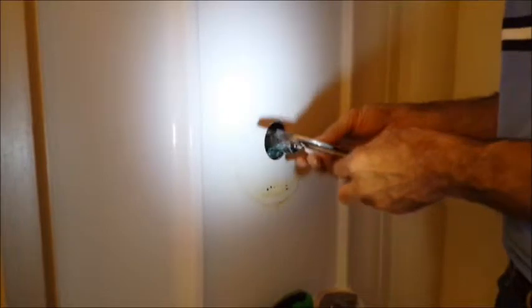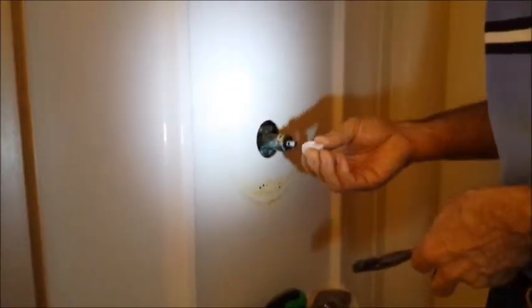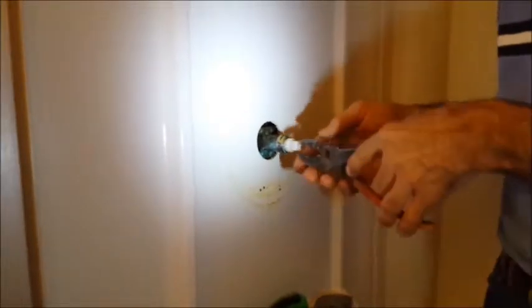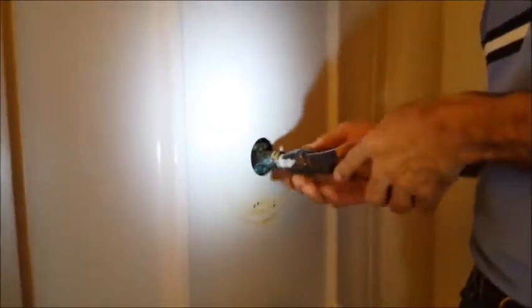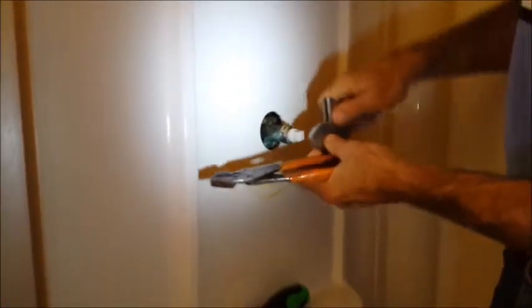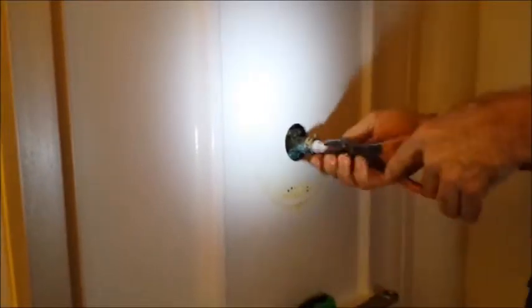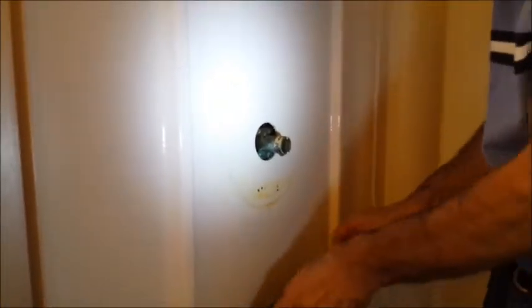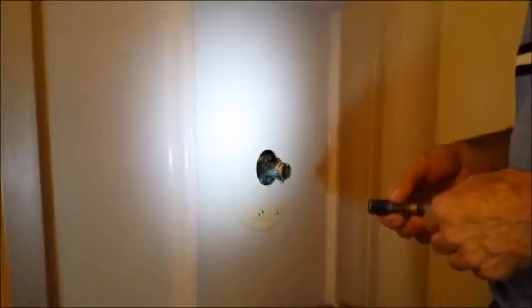Okay, so if you run into a hard valve to pull out, they send this little tool, at least Moen does. You can see how it kind of locks into the cartridge. And you can use this to turn it. Sometimes you have to turn it hard. That's why I brought this wrench in. Sometimes you got to really crank on it to break that loose. And once you break that loose sideways, then it'll pull out easily, kind of like ours did to start with. So here's the old cartridge. We're going to put the new one in and see if that solves our problem.